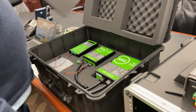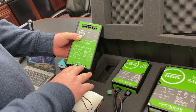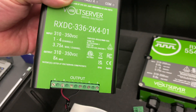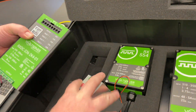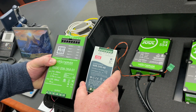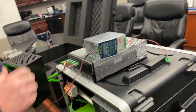The next piece is one of their DC receivers. This receiver takes digital electricity in and converts it to a normal DC output — in this case, about 336 volts DC, with a range between 310 and 350, where 336 is the sweet spot. Here we have it connected to a Mean Well power supply, which converts the output voltage from the Volt Server receiver down to 48 volts for the PoE switch. Both are DIN rail mountable, so I'll go ahead and install them on our DIN rail.